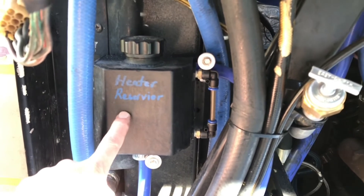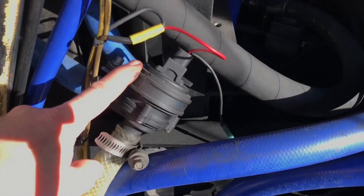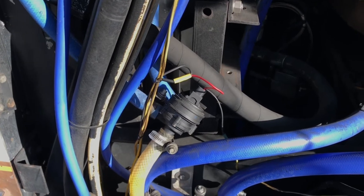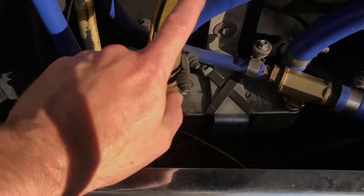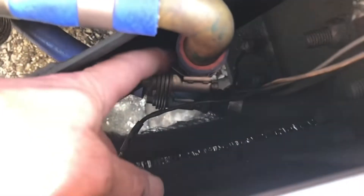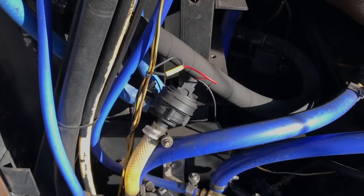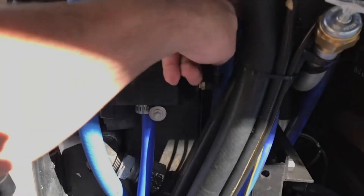What happens now is I have a separate small reservoir that I added — I'll link it in the description. This goes down and I have two AC Delco pumps: there's one there and one down there. Those two tie into the original power — the switches for the chassis heat and for the front heat. One pump feeds one loop and the other pump feeds the other loop, and then they both return through a tee down there. There's also a balance line — I have two balance lines for that reservoir.